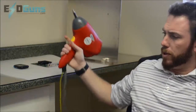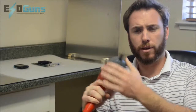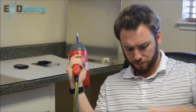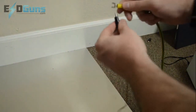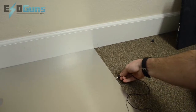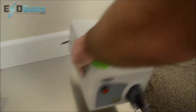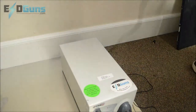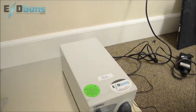Here is the NSG 437 pistol, with tips easily interchangeable by screwing on and off. The ground cable is permanently mounted into the bottom of the pistol. Follow the ground cable to the end — we are going to hook an alligator clip up to this, insulate it with some electrical tape, and connect the other end of the clip to the ground plane. The IEC standard will show a diagram with the ESD base unit on top of the ground plane, but this isn't essential for your testing.